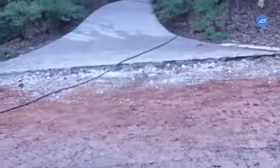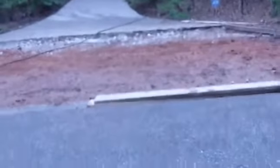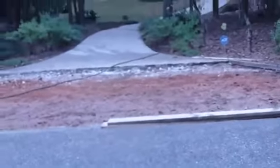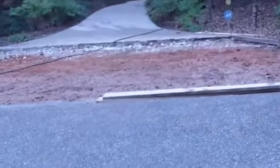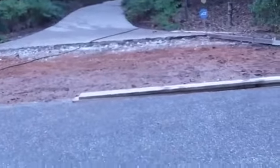Here's another thing that we've done — I even pressure washed the gutter. Look how dirty that gutter is. I've actually cleaned this gutter going this way so that the gutter is a lot cleaner and it matches the new concrete that we're fixing to pour right here. When I'm pouring this concrete, I'm going to put an expansion joint right down the middle of the driveway both vertically and horizontally. If it ever starts to move, it will crack in the control joint — I'm going to make sure that it cracks where I want it to crack. It's called a control joint or an expansion joint.